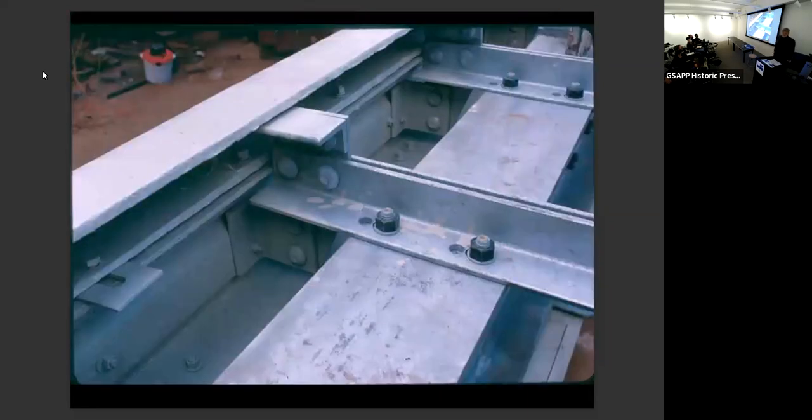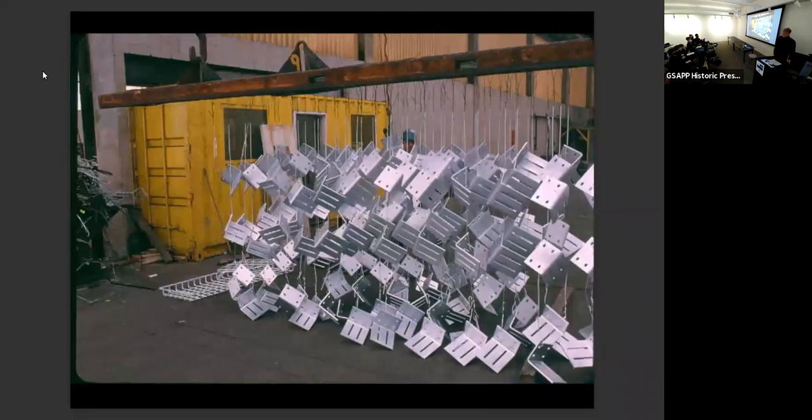And all the clips, everything, all the exposed fasteners on the cast iron were stainless steel. And people say, well, Pieper, what about galvanic deterioration? But in fact, you have a very small amount of stainless steel, a lot of steel and cast iron, galvanic action is nil. So, but all the clips and things like this that had rusted needed to be galvanized as well. So everything that was made there was basically galvanized. Everything we needed to attach, to reattach it, the steel was galvanized.